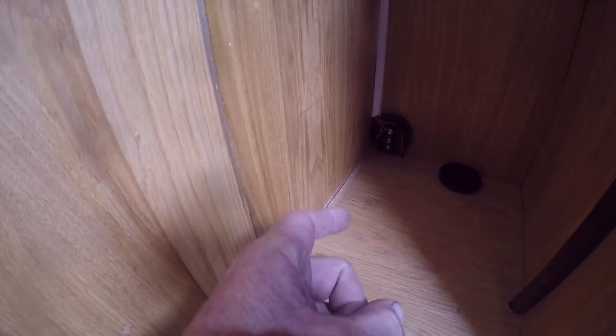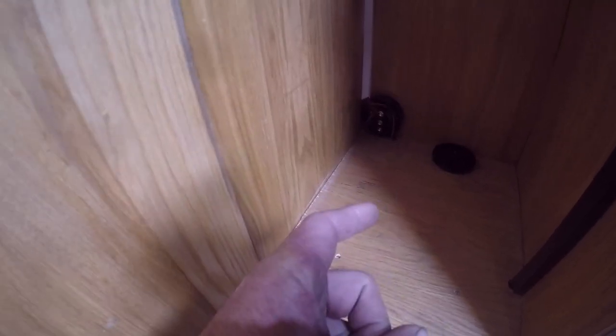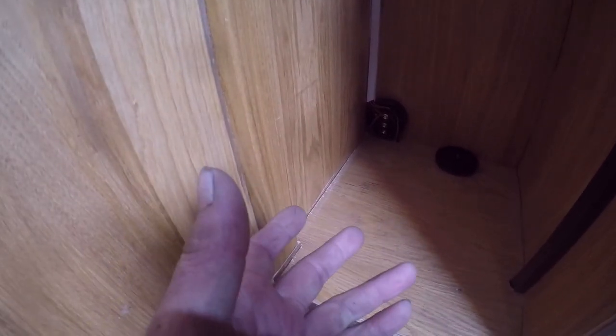Right, so today — quick video — I'm going to be doing LED strip lighting around the inside of this bunk so when the kiddies stay in it they can have it all up in different colors. LED track first, then a bit of power out of the cupboard. That down there is not the correct thing to use on a boat — that is a 240 volt junction box, no no no. I'll just bring off a fused connection up to a USB socket and a feed up to these lights.